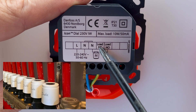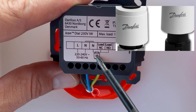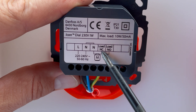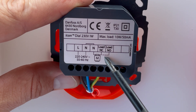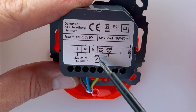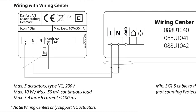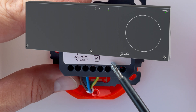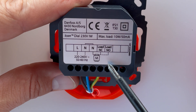As you see, the actuator can be connected directly to the thermostat — 230 volt NC type or 230 volt normally open type. NC means without main supply the actuator closes the valve, and NO means the actuator without electricity opens the valve. The actuator can also be connected to a wiring center 230 volt controller. This thermostat can regulate up to five actuators.